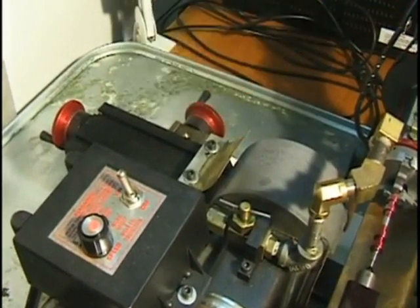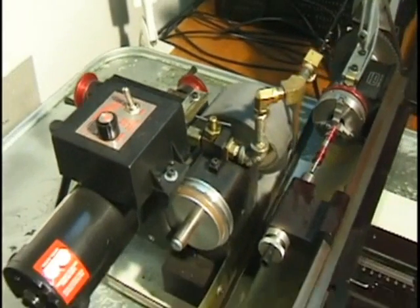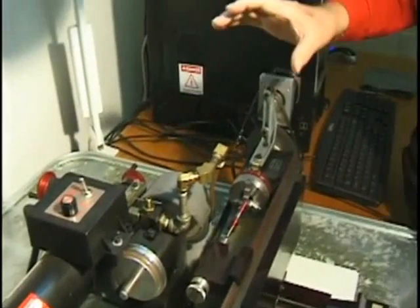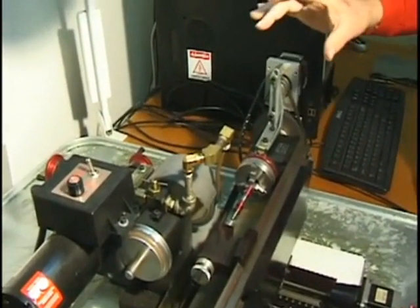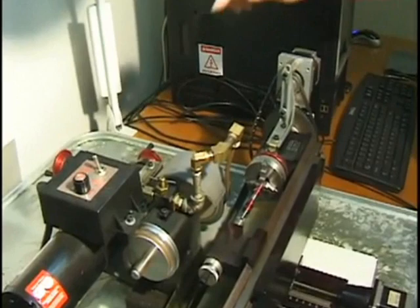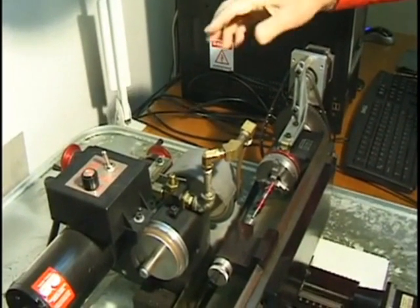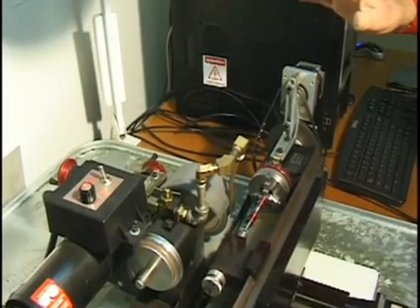That dresses up the wheel. When you're grinding something, the wheel stays the same diameter — if you're doing it right, it doesn't really break down. And a diamond doesn't wear out as it cuts across there. These two things are assumed.